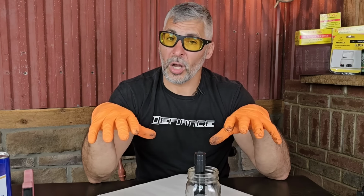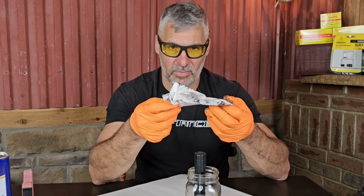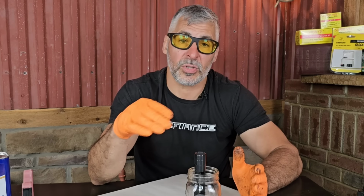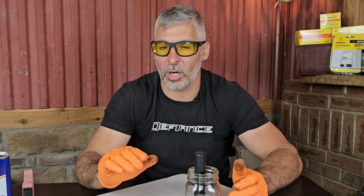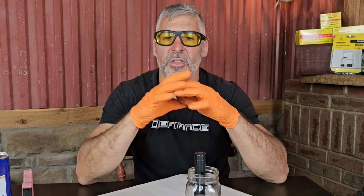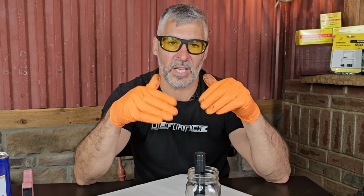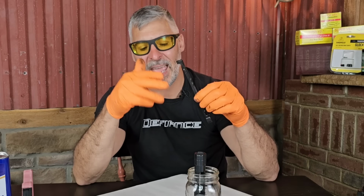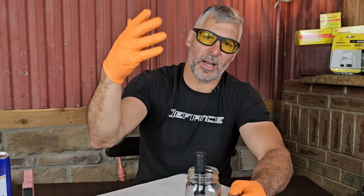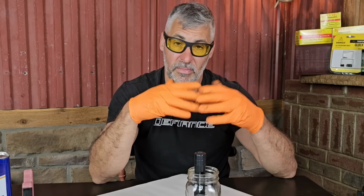Safety. When we're done with this, I do not want to take these rags that are going to be soaked with this and throw them in the garbage. This is not a made-up thing. My uncle's house almost burnt to the ground during construction because a painter, using this, took those rags and threw them in a bucket and left the bucket on the second floor of the house. Spontaneous combustion can happen as this and other such spirits evaporate. It creates heat, and it happens a lot.